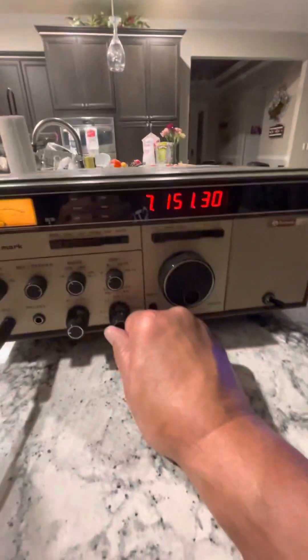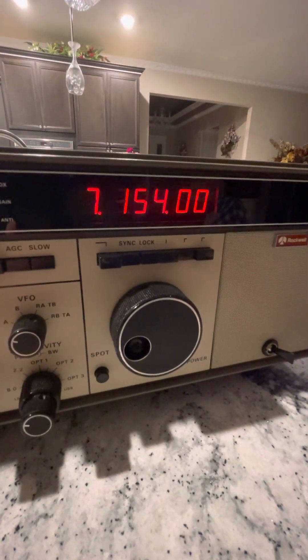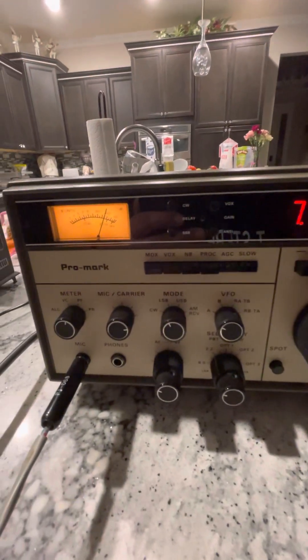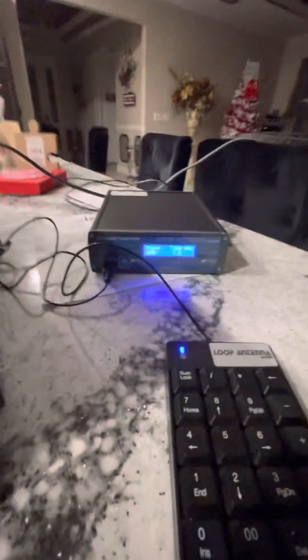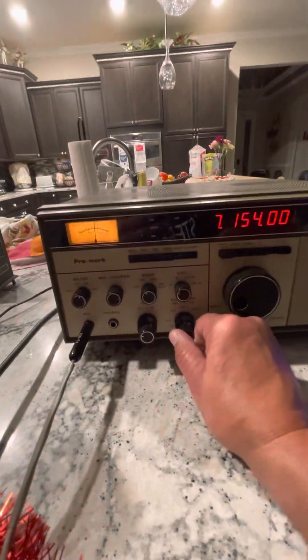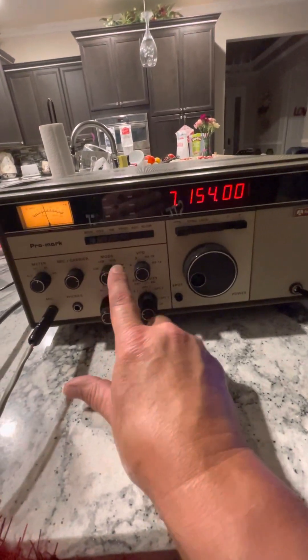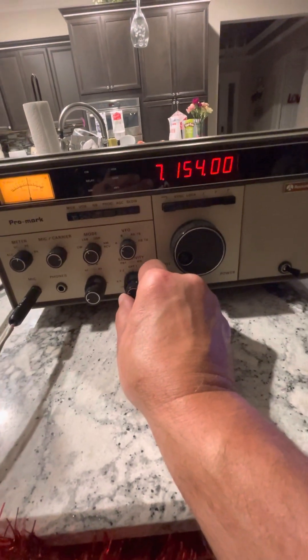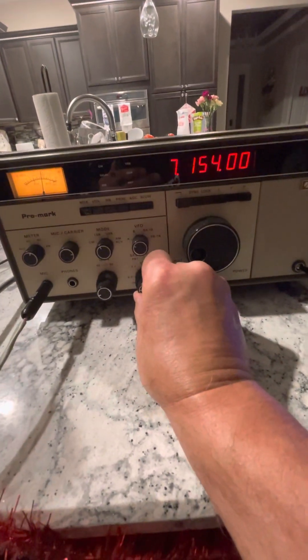Just to show how it works live — I'll find a station on lower sideband. This guy right now is around S7 on 7154. I'll input 7154 — you can see it showing up on my display. There you go — 1.5 to 1 on 7154. With this radio you have to switch sidebands manually and shift the filter passband over from where it defaults.